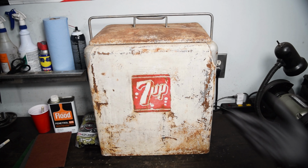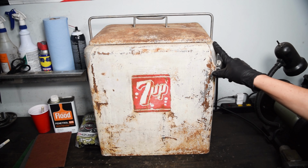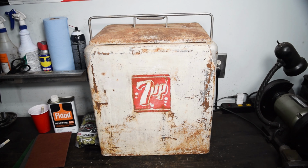Then we're going to treat it with Penetrol, which is just a paint additive, but when used by itself, it adds a really glossy finish that, one, levels itself out, and two, will last at least 6 months out in the weather. For any stainless stuff, or rather this might even be aluminum, it's just going to get rubbed down with Quad Zero steel wool. The rest of it is going to be wiped down with one of the three grits of Scotch-Brite, depending on what responds the best.